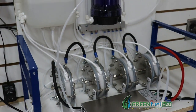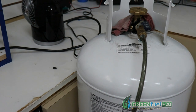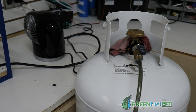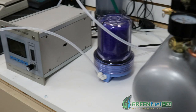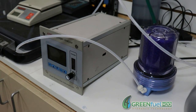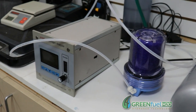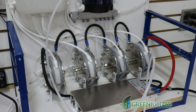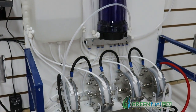I expect this is going to take a while to get up to 20 PSI. Once we reach 20 PSI, we're going to use our hydrogen analyzer and test the purity of the gas to make sure we have it above 96.5% to 97%. That's going to take quite a while, so I'm going to pause this video and we'll come back when it's under pressure.